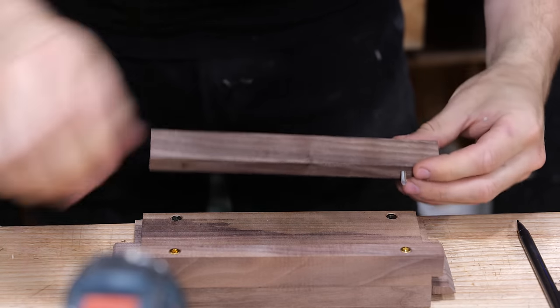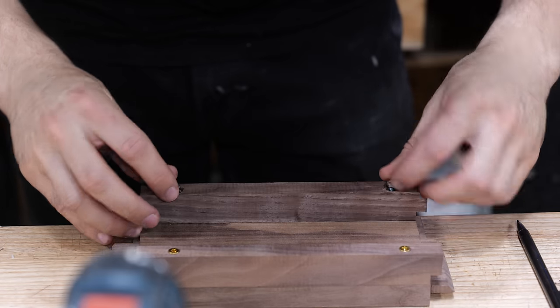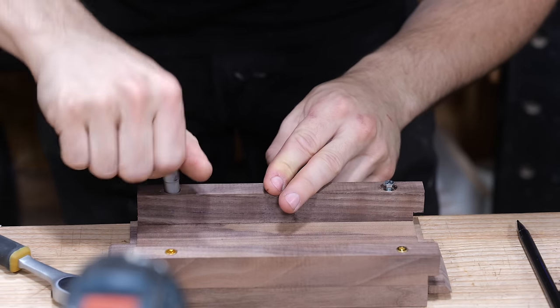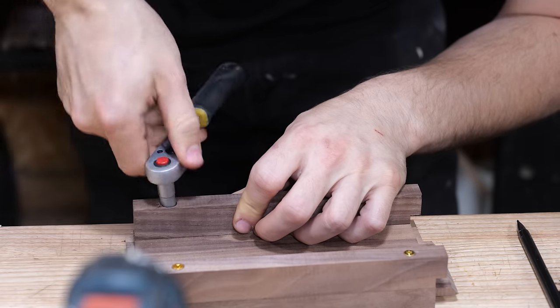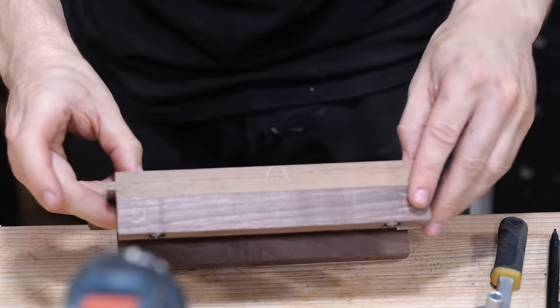I always find putting a little bit of candle wax on the threads helps these go in. The key is to start off as level as possible — it is possible for them to veer off course. Just bottom them out, don't over-tighten them. Now you can thread straight in and we've got a lovely fixing into that wood. This is the primary reason I love using these inserts — it's so much stronger and more durable than a screw. If you use a bolt with an allen key head or cross head, you get all the advantages of a bolted joint with the aesthetics of a screw.